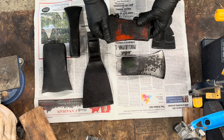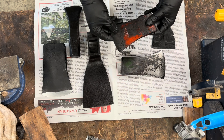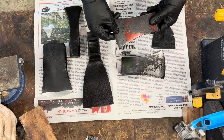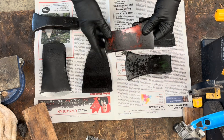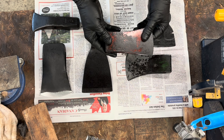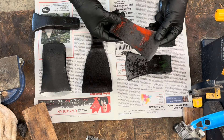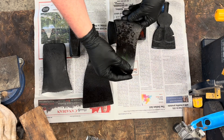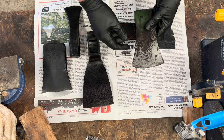It's also nice for axes where you want to restore them, keep the patina, and save the paint — wire-wheeling to get rust off would also remove paint and leave bare steel. One issue is that if you've done several axes in one batch the water gets very black and tends to darken the paint. You can put the piece in clean boiling water afterwards to re-brighten the paint. With this little Sandvik hatchet that worked out quite nicely, and with this Walters pulpwood axe I wanted to keep the remaining green paint, which worked out well.